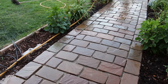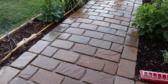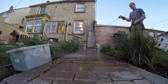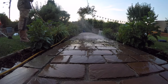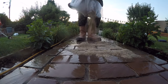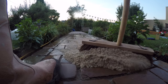I'm probably only going to manage half of this tonight as it's getting pretty dark already, but as you can see I've wetted this right down with the hose. It's really emphasized on the packaging and instructions that you can't over-wet this, so I've really gone to town soaking it through for about five minutes before I start. Then we'll keep it wet as we go — you can do this in the rain as well, and as long as you keep the stone wet itself it won't stain it at all.